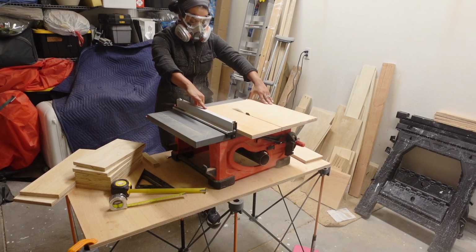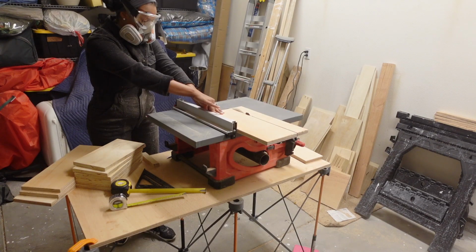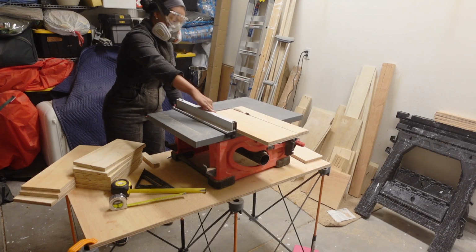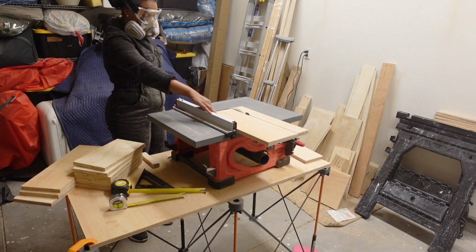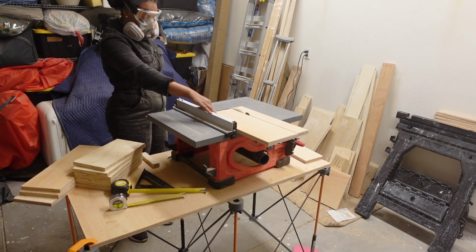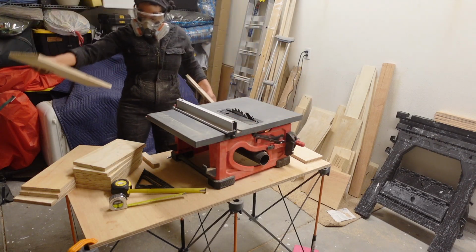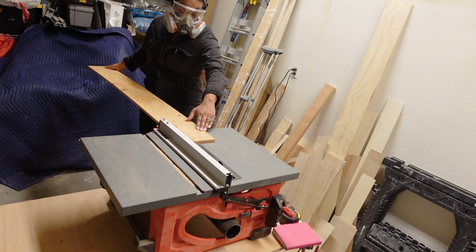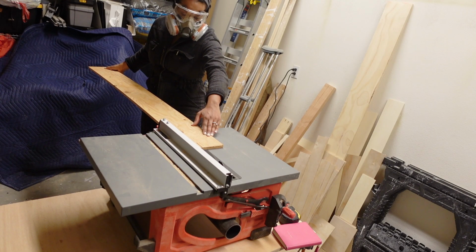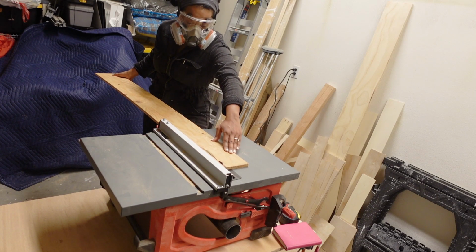And again, if you want, I'll leave some links down below for how I learned how to get these measurements. But basically, you just want the drawer width to be smaller than the opening of your face frame, and also small enough to add the ball bearing slides to the side. Those are usually about a 1/2 inch thick, so those two together would be 1 inch thick. And I need a spacer, also a 1/2 inch thick, to add, which I will show you later.